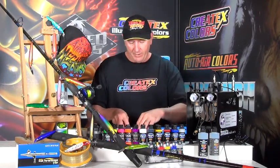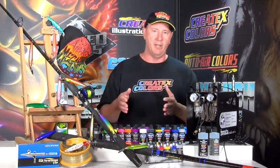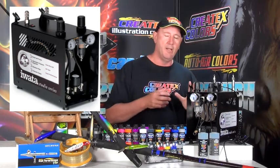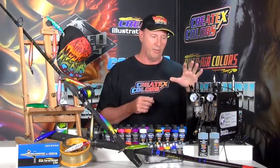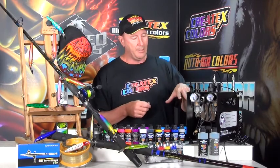Now, both these airbrushes we trialled on this particular compressor, the PowerJet Pro, and we got 60 psi with both of these airbrushes, so that's plenty. And you can dial it down, of course, to whatever you want. So the PowerJet Pro itself is a silent jet, it's an oilless piston, no maintenance, dual piston. This one on top has got plenty of psi. It weighs just 12 kilos, it's a 1.6 horsepower, and it's got a 2 litre tank in it.